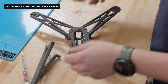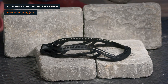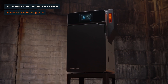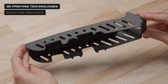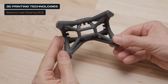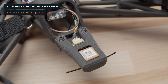SLA 3D printing offers the greatest material variety and specialized properties like impact resistance, high temperature tolerance, rigidity, and electrostatic dissipation. SLS 3D printing, with materials like Formlabs Nylon 12 Tough Powder, creates lightweight, high-strength parts ideal for mission-critical applications. The self-supporting nature of SLS printing enables complex, organic structures that traditional machining simply cannot achieve. These materials are perfect for drone frames, enclosures, brackets, and sensor housings.